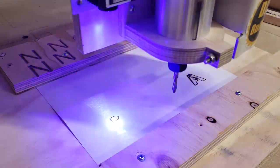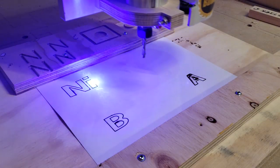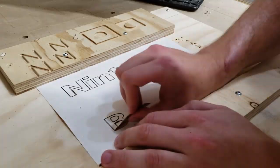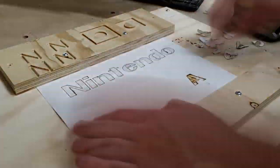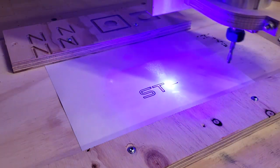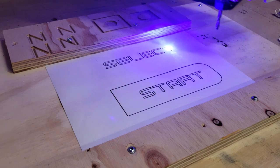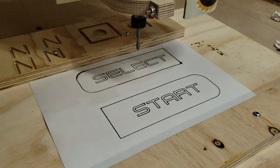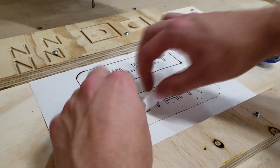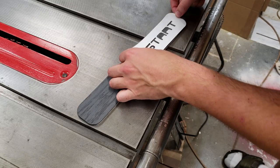To create the red lettering for the Nintendo logo, B and A buttons, and start and select buttons, I used my laser on a full sheet of label paper, cut out the letters, and used the negative of those images placed onto the wood before spray painting on top. This worked out fantastically — it wasn't totally opaque, so you could actually see a bit of wood grain underneath. After the laser finished cutting, I used a utility knife to peel up the labels, being careful not to lose the inside pieces of letters like A and R.